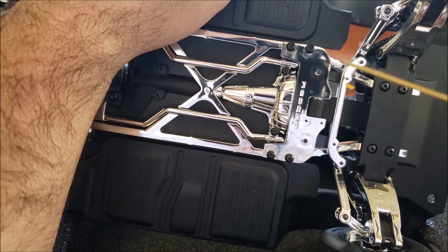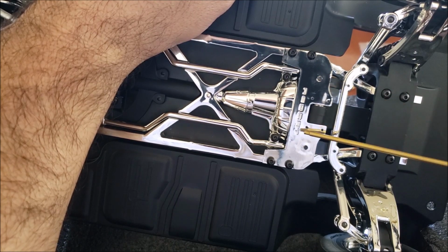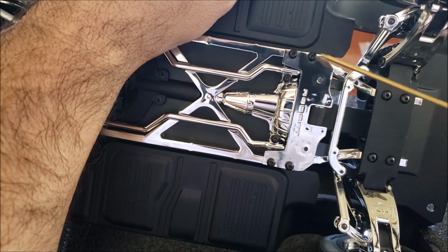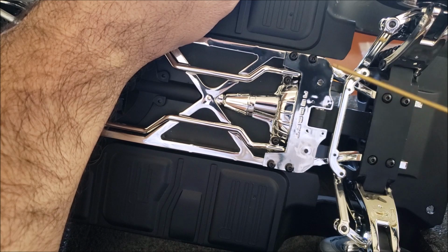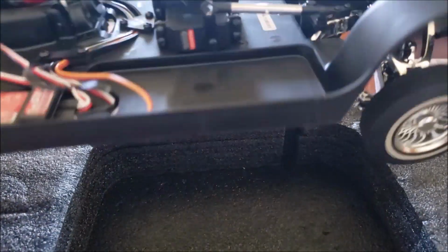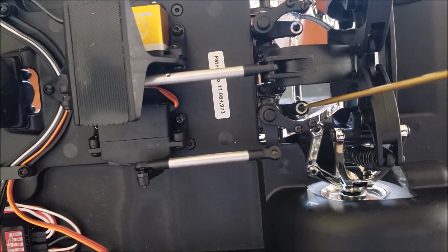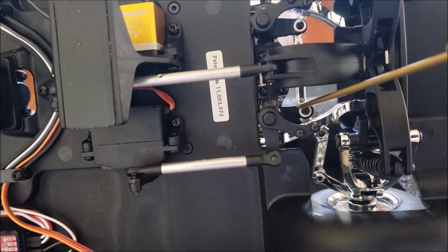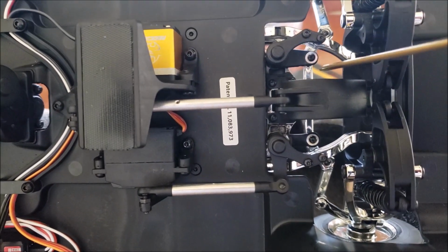And this plate also right here, this plate is not what I thought. It was a little more disassembly involved in it. Is this piece right here. So you loosen these screws right here, these four, and then you have to go in on the other side, and you have to release it from here. And there's two bushings. So this screw right here has a bushing that goes sitting in the other piece here, and then you have the other side over here.